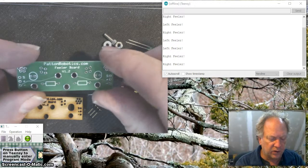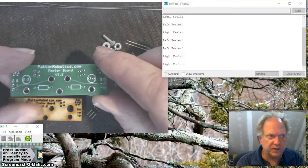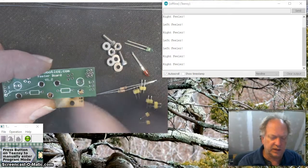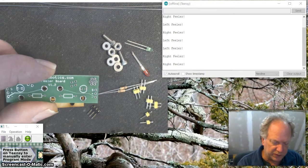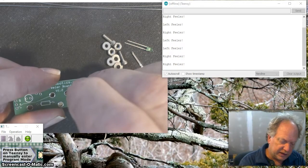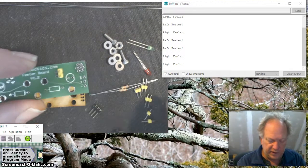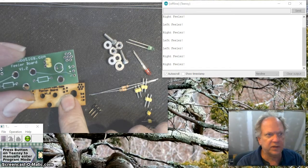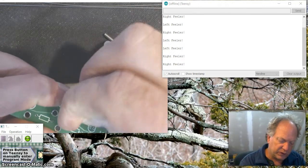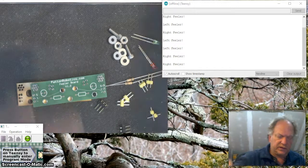Okay. So normally you want to start with the lowest component first. I find that actually this board, especially if you're using this template, it's better to start with the tallest components first, and then it's easy to add the lower ones in. There's plenty of room. So I'm going to do that. I'm just going to start populating this, and oddly enough, sometimes we load the wood first, but I think in this case, loading the board first. So I'm going to go ahead and put the groups of two. There should be 4 groups of 2. And I'm going to need my glasses. Hold on one second.